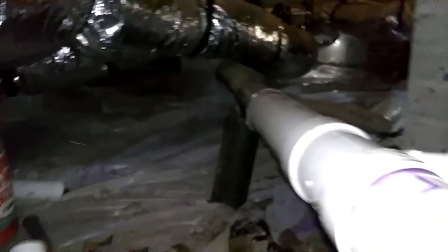It's a pipe with this band here, but we got it on — I just got to tighten it up and show everybody the work down here. That's where I'm tapping into the cast iron right there, coming in. This is my 90 going up. I'm going to put a P-trap upstairs. This is my putty, and this is my connection to the mirror right here.